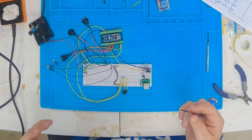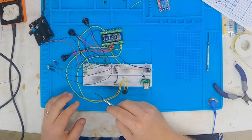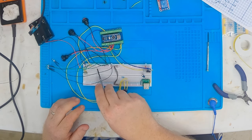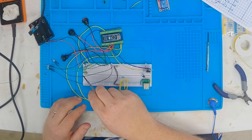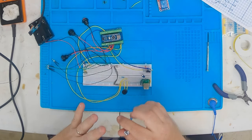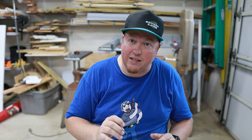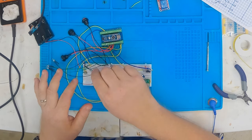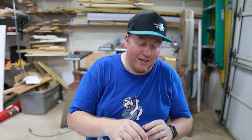I have everything wired up except for the relay, the latch, and the internal batteries. There is a correction I talked about earlier - after talking to Dave Wagner, DJW House, he pointed out a mistake I made. I had to change how I was bringing power into the DC-DC five volt step-up: the external power comes into the step-up first, then the five volt output goes into the rail and feeds five volts across the whole protoboard. I'm learning as much as you are through this process.